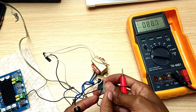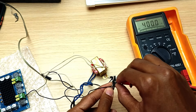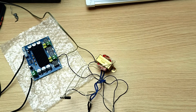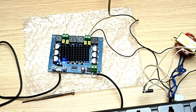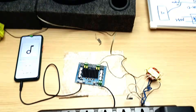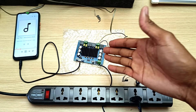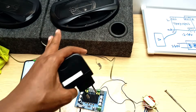Now let's measure the continuity of the output stage — that is connected. I will connect the whole circuit together and see if that annoying popping or thumping sound has disappeared forever. The music is playing fine, and now if I turn off the power — there is no thumping annoying sound at the output stage. So this is my solution: a very simple method that I can replicate on a strip board. With a separate power supply, I can now connect the amplifier to a 19 or 24 volt power supply to get even more powerful output from the speakers.